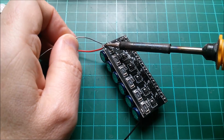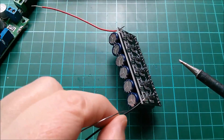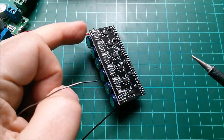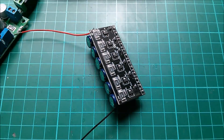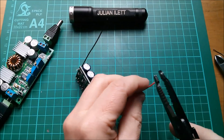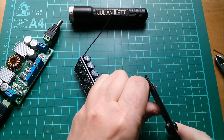These are plated through but they might be plated with a lead-free solder. I'm not actually going to clip those protruding wires off because I think they'll be useful to attach my multimeter to. Now, measuring this back feed — if there is any back feed — how are we going to measure it?